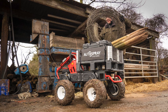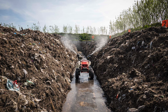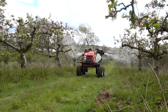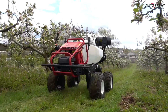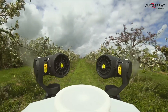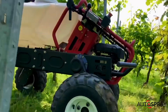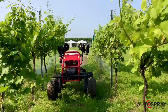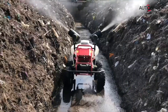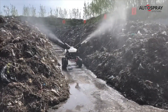We've established what it is, but it's what it can do that's of real interest. This is a brand new class of farm vehicle and it's only now that we're discovering how farmers want to use it. Originally it was designed as an autonomous spray platform, so let's start there. It can be supplied with a demountable fan-assisted spray system, perfect in fruit growing and orchard settings. There are twin spray cannons with very powerful fan assistance. These cannons can be fully synchronised or controlled independently, and with a six-metre vertical or horizontal reach from each cannon, it can cover up to 12 metres in a single pass. They are being used to treat apples, cherries, vines, plums, strawberries and raspberries — it's even being used to spray flies on compost production sites.